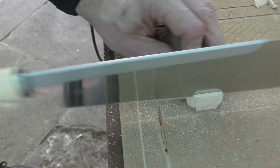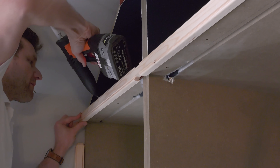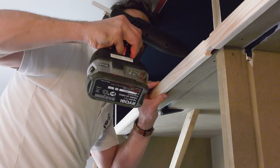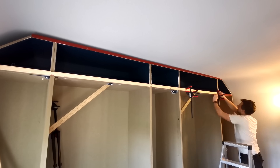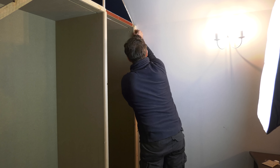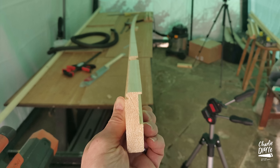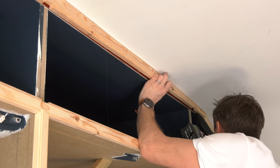The vertical sections of the fascia where they intersected the metal band also needed a minor rebate — another job for the tatsubiki saw. As I couldn't easily screw through the metal strengthening bars, I decided to glue the fascias into position using my glue gun, loaded with a 45-second glue stick. This proved pretty effective and I ended up using it for all the fascias, although in hindsight the 180-second glue sticks might have been more appropriate as I made a few minor positioning errors because the glue went off too quickly. The exception was the top fascia where I used a combination of glue and lost-head screws, as the redwood had warped quite badly overnight with most of its structure removed by all the routing.